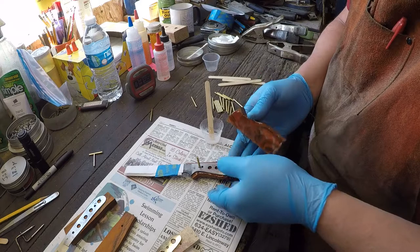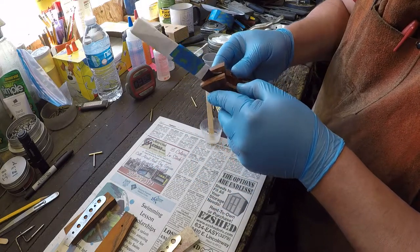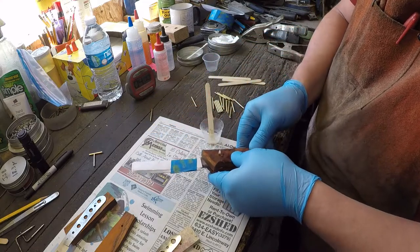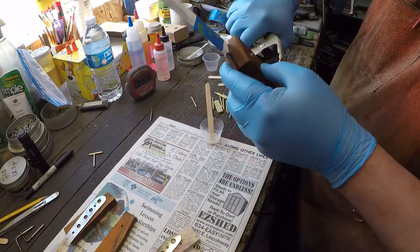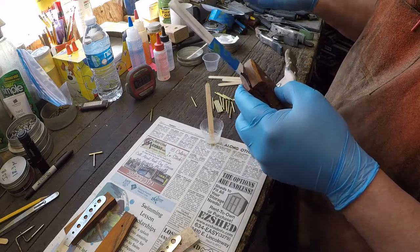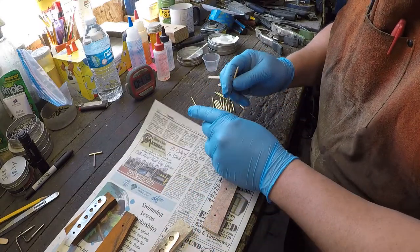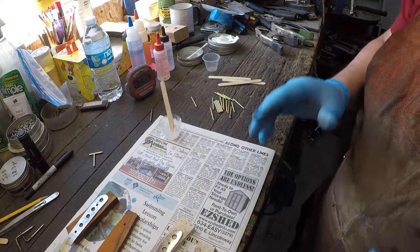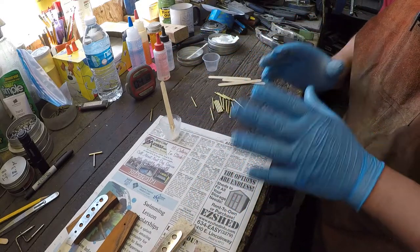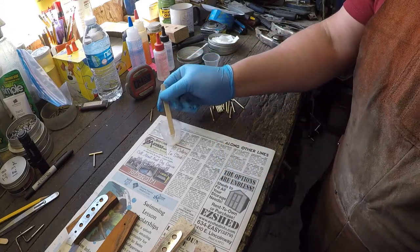That's pretty even. You want to make sure you put enough epoxy on there to where there's enough to fill those epoxy rivets. Okay. So again, we'll go ahead and do that there, and this there. We're at 4 minutes, so that's going to give me enough time. And I don't have quite enough epoxy to do that next one. That's okay. So we're at our 4 minutes and 20 seconds, right?